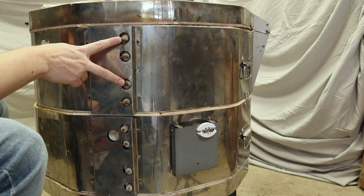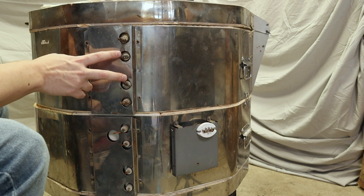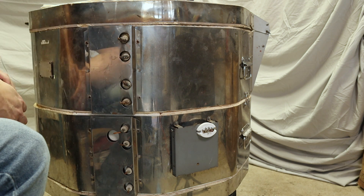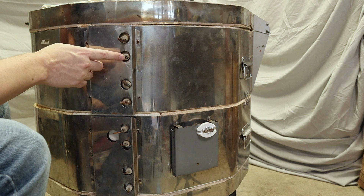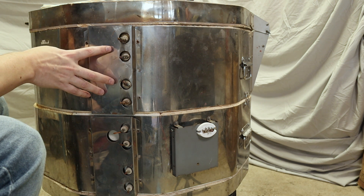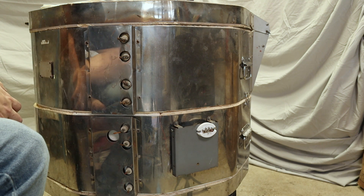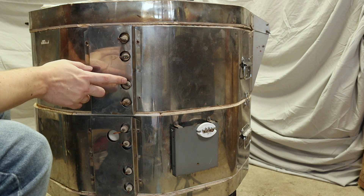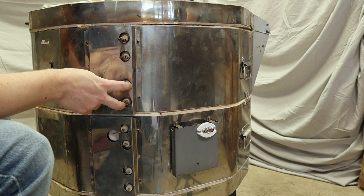Power will be coming in to one lead and exiting. It doesn't matter what the order is in terms of power coming in one or the other — I just want to make sure I have power coming into both. Since the elements are just big resistors, there really is no directionality — there's no positive or negative. So as long as I wire them in parallel it should work. I'm going to make some short jumpers to connect them so I only have one set of high temperature wires coming in to feed the kiln.